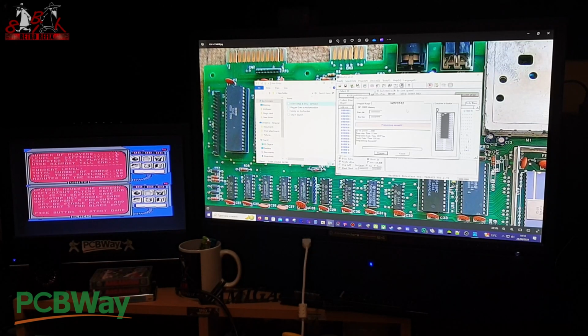I pulled out another 64. The ones that did work didn't work, and the ones that didn't work did work. Confused.com. So I pulled out my 64 clone, this one, which I've built myself from scratch, that has all new parts in it, and it just fires them up every single time. Just make sure that you clean all your flux up off that board before you start shoving them in them sockets, otherwise they're going to give you problems. But other than that, absolutely fantastic.